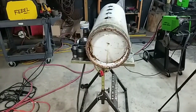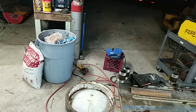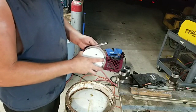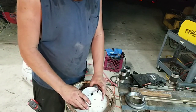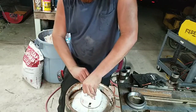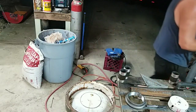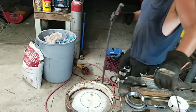I was trying to figure out how to mark out for this bung, because this ring needs to drop down into the tank. A five-inch Milwaukee Hole Dozer fits on there perfectly, so we're going to center the hole dozer in the bottom of the tank — just eyeball it, close enough — trace around it with a marker, then cut the line. That will give us a line to follow, and it should be dead on. The flange is so large on that welding bung that we've got plenty of material to work with.